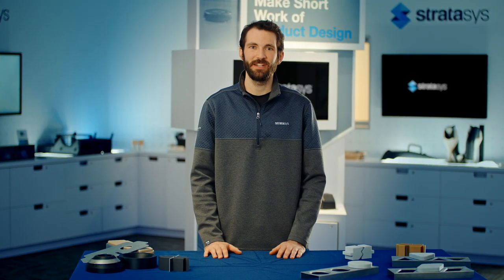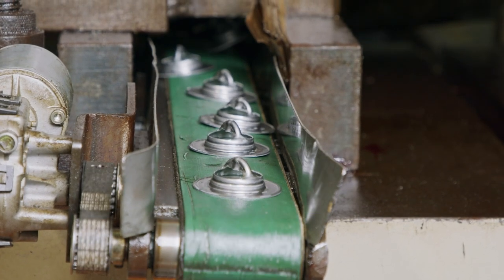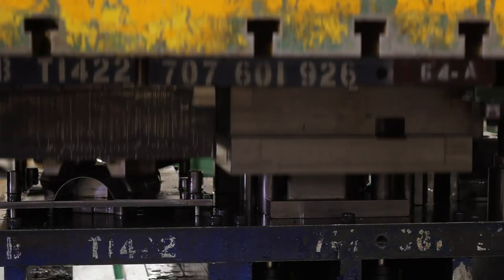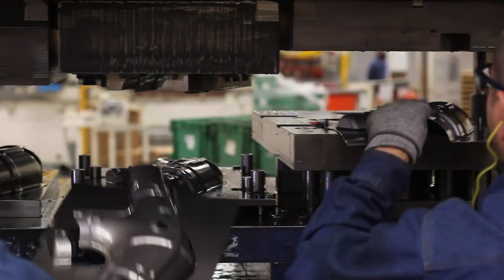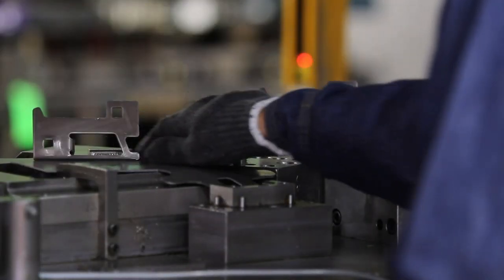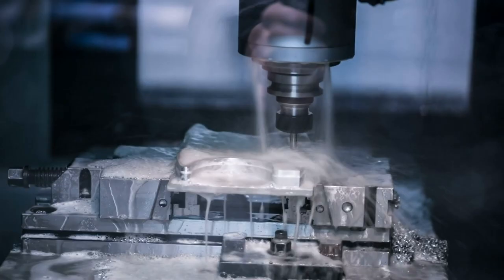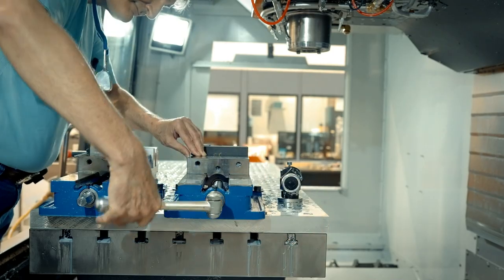Typically, metal forming dies are used in the manufacturing process when thin, relatively simple sheet metal parts need to be made at scale. Most of the time these dies are machined from tool steel, which is time consuming and expensive, especially for low volume production. Sometimes revisions are made to the tool to account for changes needed after fit and function tests, requiring additional machining that adds time and cost to the overall project schedule.